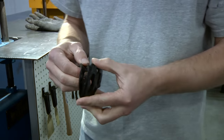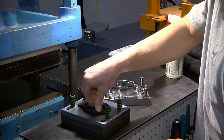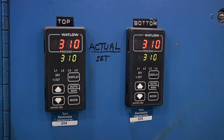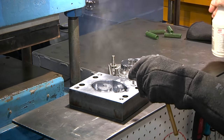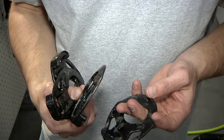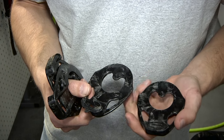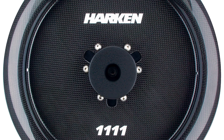You can compare it to little sheets of plywood almost. You stack the layers of plywood together, put heat and pressure on them, cook it for 10 minutes, and out pops a finished part. Every time we pop out a side plate we apply and polish a mold release. If you look closely at the part it looks very similar to oriented strand board. Most of the carbon you see is cloth — it's a weave pattern, but this is very random. Fibers are all different directions so that it has uniform properties depending on how you load it.